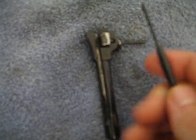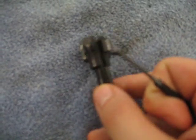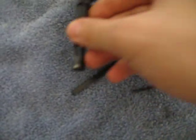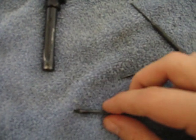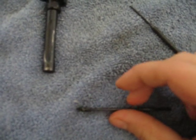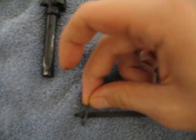You want to get a pin press and press on that hole right there. It's going to push this pin out. Once that pin is out, just tilt it back and the firing pin should come out. The firing pin looks like this — it's going to have a little dip in it right here. The pin goes in there and locks the firing pin in place.